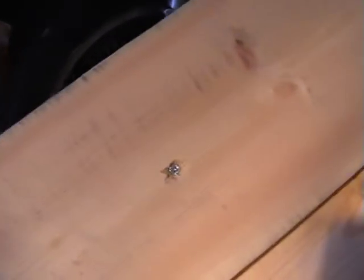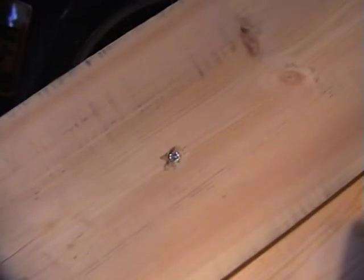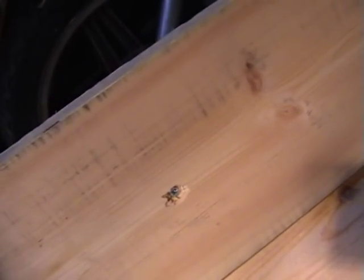To attach it onto that reference board, what I've done is put a screw going through the reference board into just the end of the bowed board. Don't forget to countersink that, because you don't want it catching. And I've done the same at the other end.